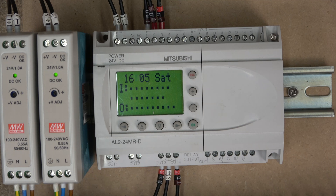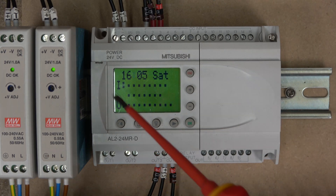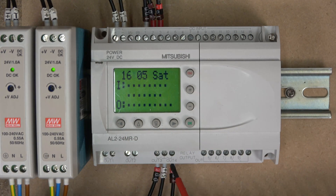Regarding outputs, I have a second power supply. The S terminal is coming to the relay common. Each relay output — one, two, three, four — there are four or five of them. Each relay can have a different voltage if you wish. I'm using 24 volts and using one common for the outputs. You can also have separate commons for different relay groups if needed.